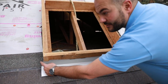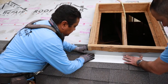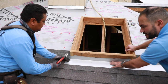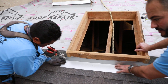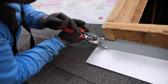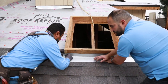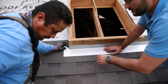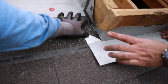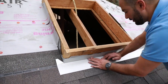We've got a little bit of fabrication to do at these corners because the corners are what matters and that's what we have to pay special attention to. We want to push this snug up and Marco's going to demonstrate how to properly cut it and make our markings. He's actually using his tin snips right now to make a line at a 45-degree angle. You can see this flange will get bent down and this flange will slide over to the side. Another thing we like to do is round these corners off and bend these in on both sides.